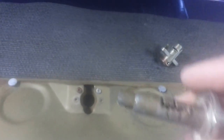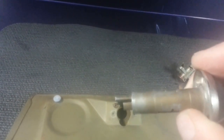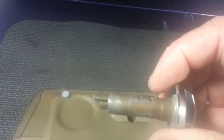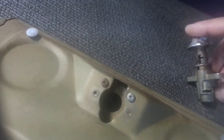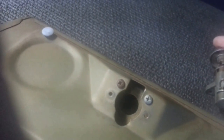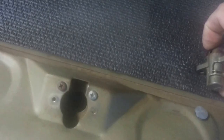Okay, with the cylinder out you can see that little spot right there. The pin I was depressing was this little guy right here that sits right on the edge. You'll see this one's kind of gummed up so it doesn't come in and out very easily, but that's the little pin you need to depress that goes inside that little hole. In order to get it back together, same thing — you need to press and hold the latch up like so, hold that in place, depress that pin, and then push it back together.